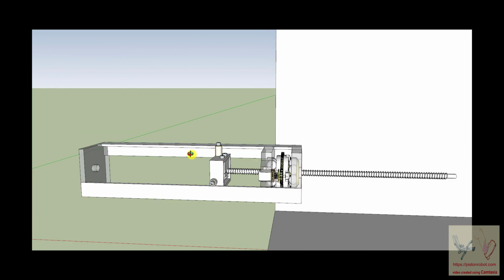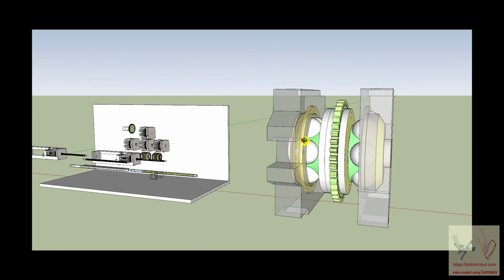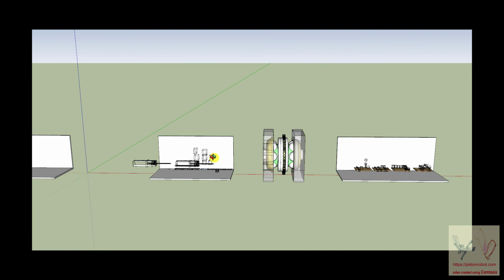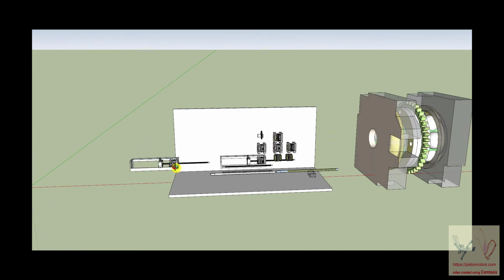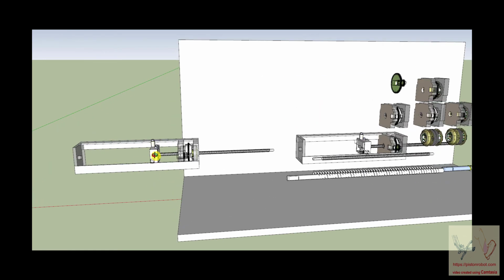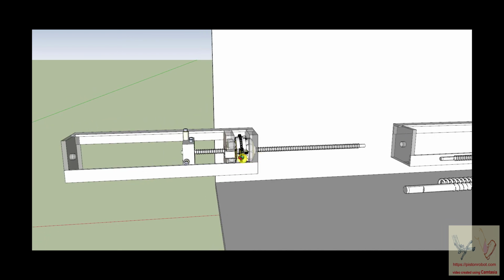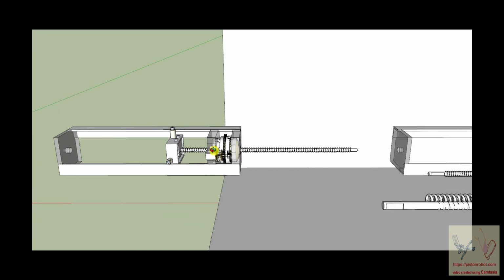We made it cheap. I resisted my temptation to make it better, but you can see all of this is how to make it better. And I'm going to go over that in a minute, but we're done at this point with the series where we're discussing making the inexpensive linear actuator equivalent of a hydraulic cylinder. Because if you want it to go this way, you put the plus and minus voltage one way. And if you want it to go that way, you put the plus and minus voltage the other way. And it's not sophisticated. It doesn't have a servo controller. It's a toy. So there you go. And now we'll go do some other stuff, but I just wanted to wrap up the toy side of this.